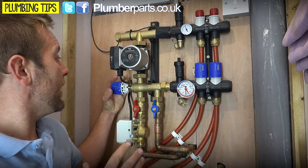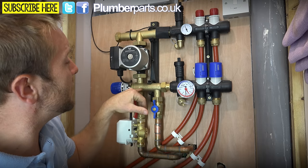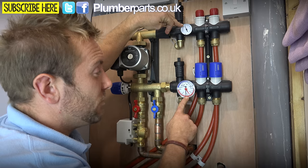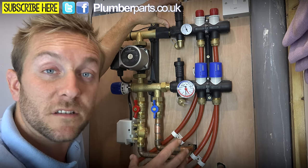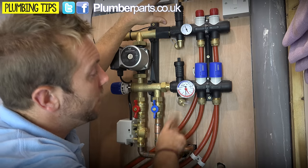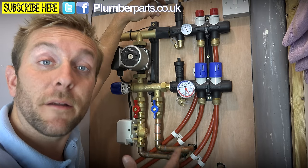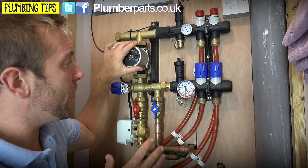Now, what we'll do is use this gauge up here to detect how much hot water is actually going through the system. Now we use this gauge here to really judge the return temperature. It gives you a good idea as to whether the system's working properly or not, and it's more of a diagnostic thing for if there's any problems. Well, that's what I tend to use that gauge for. And also, obviously, it's got our pressure on there as well, so we can tell the system pressure that's going into the manifold.